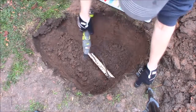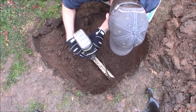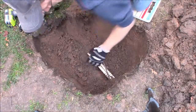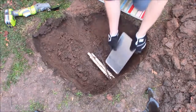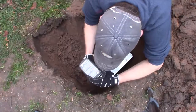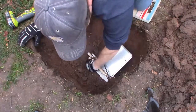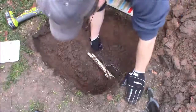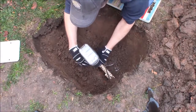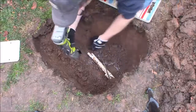I'm going to use my little tool here. It just cut through like butter — not all that much water in the line. I cut the smaller zone supply line back here. It looks like I didn't get a very square cut, so I may come back and square that up. The cap fitting will fit a lot better if it's square, so I'm going to cut these a little further back to get the cap physically in there.